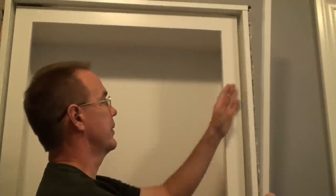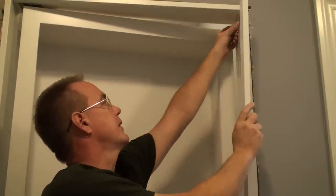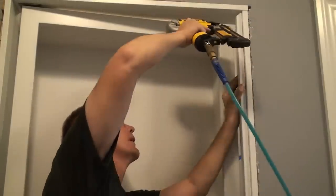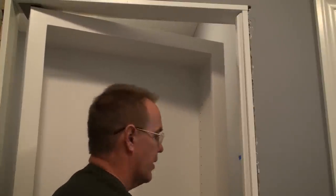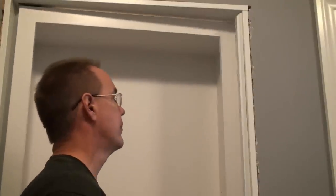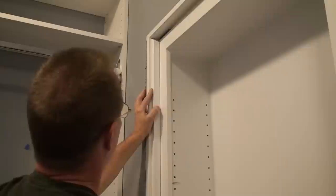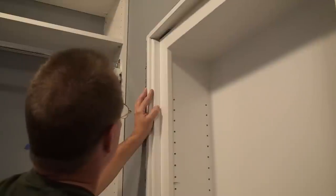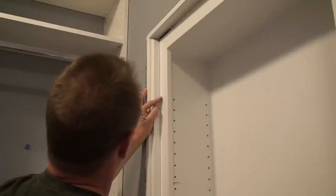This is the non-pivot side of the door — we're going to start putting in our door stop. This is a three-quarter inch stick; I made it an inch wide and made a mark an inch and a half in. I'm going to get that first one started, and that's the only measurement I'm going to take. The rest of it I'm going to fit to the door as I work my way all around. On the pivot side, you'll find it's necessary to leave a little smidgen — if you have it too tight there, it's going to hit as it closes.